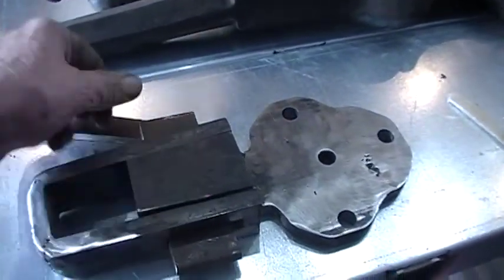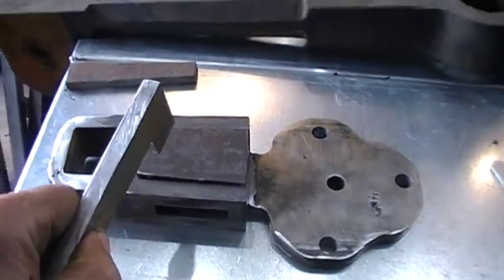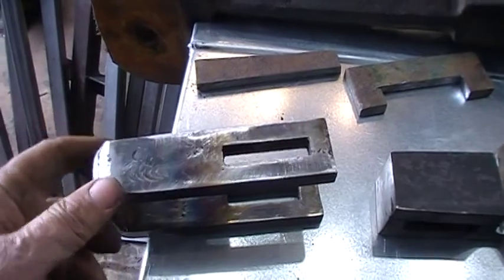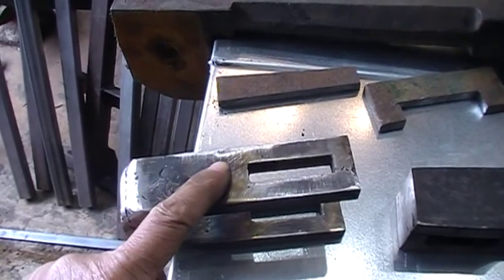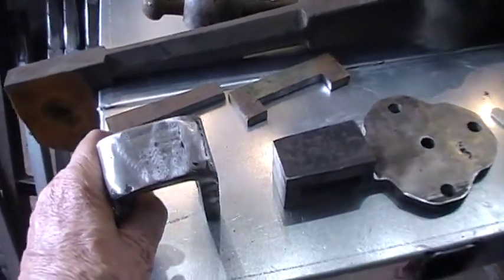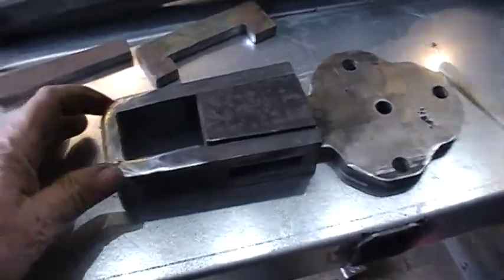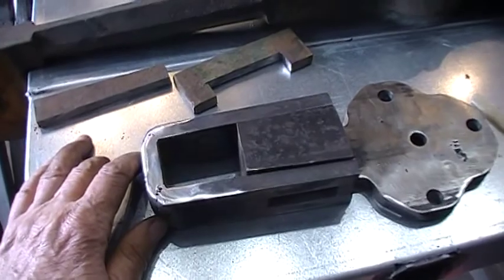I'm going to show you another one I built — it's not as tight, just slides in. These are for two different vises. This one I made out of three-eighths plate. Same construction: all half-inch square bar welded together, ground a V-groove on both sides, welded up two plates. The end is inch-and-a-half by half-inch. I put these on the vise, clamped everything down tight, and those were the last welds I made — the corner welds, clamped up on the vise.